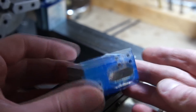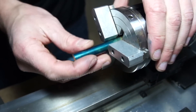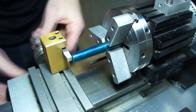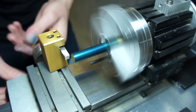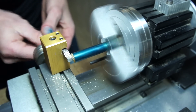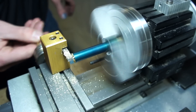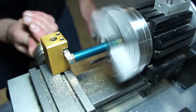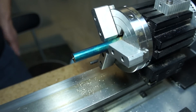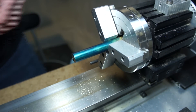And here's that little grub screw. Next I decided to make some brass washers that will go inside the knurling tool at any steel-to-aluminum contact, just to make the tool last a lot longer and because it looks nice. So here I'm just facing off some brass material. You can also see that my tool height is not set right, but I built another thing for that which I'll show in another video.